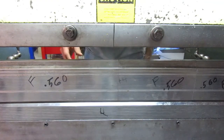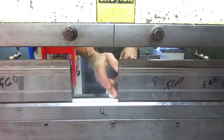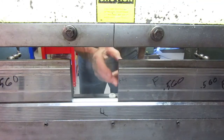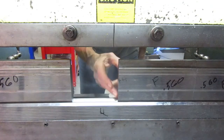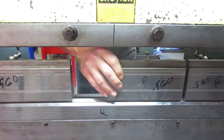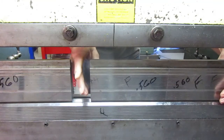It's pretty flexible. It's very important that you machine off these edges because the bandsaw cuts are probably going to be a little sloppy. You can put these in a Bridgeport, square them up, and mill them off so they're perfectly square and true, so that when they go in the machine they fit nicely and you don't have any registration problems.